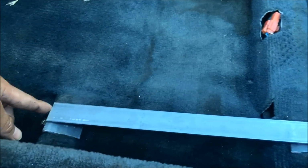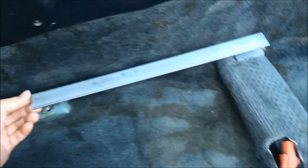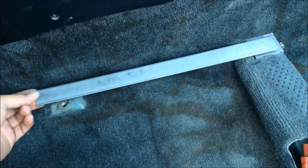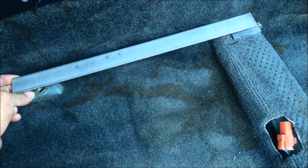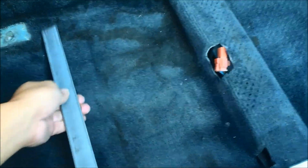Of course, we're not gonna weld it on the car. What I'll probably do is mark it, spot it, and then fit it. For the back, if you notice, this one is straight. So it's gonna be like that, but I've gotta find the right stock so that it'll be level with this. And then put a spacer. I don't know if I'm gonna weld the spacer or just drill a hole and bolt it like that. And then you can kind of imagine from there, we're gonna get another flat bar that goes across like that, one here, one there, and then we're gonna drill our holes for the sliders so that the sliders will bolt up to here.